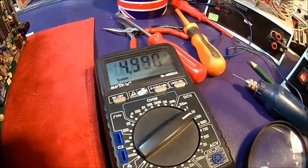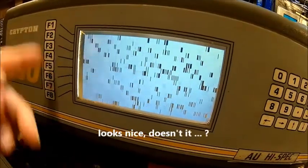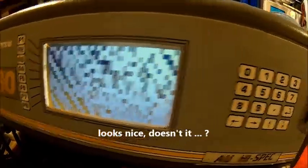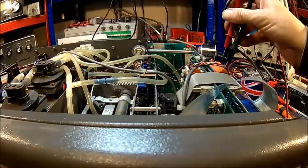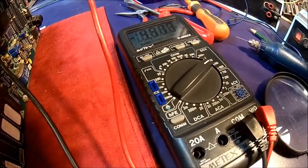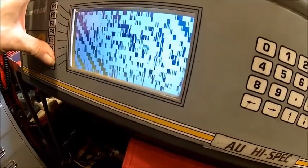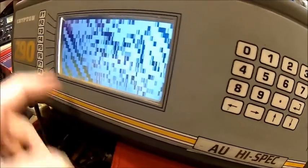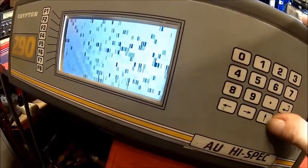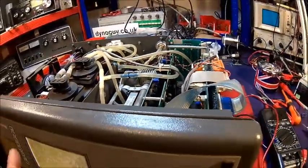I had to reset it again so we're back to three minutes. I'm gonna wait that out and see what happens — if you press service or any button once the warm-up is finished the voltage is now slightly higher, but I expect some ripple on the voltage. We've got 4.97V, the fan has just kicked in, and it's definitely unstable. Whatever we do it just goes wild, apparently reacting to the keys — everything is garbled. I believe something is just ticking out because of the low voltage.